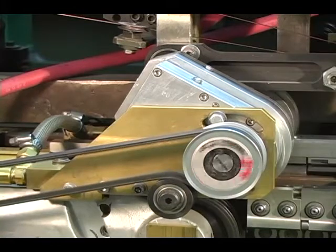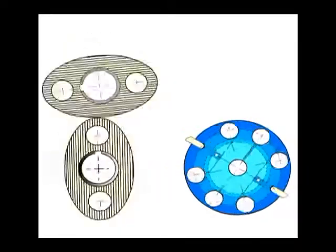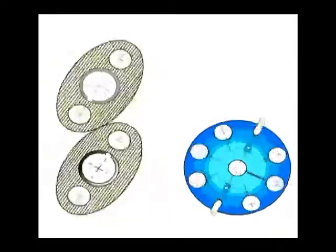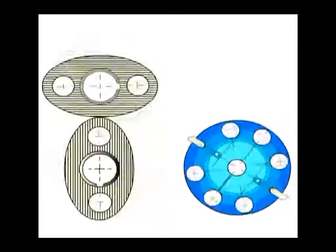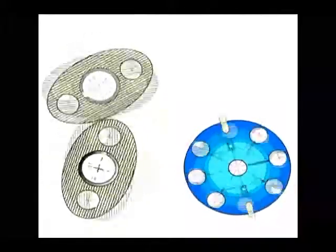The heart of the conversion is the squaring wheel gearbox. A set of elliptical gears creates a smooth rotary motion which accelerates the squaring wheel every half rotation to pick up the rounded body and feed it to the weld rolls during deceleration.